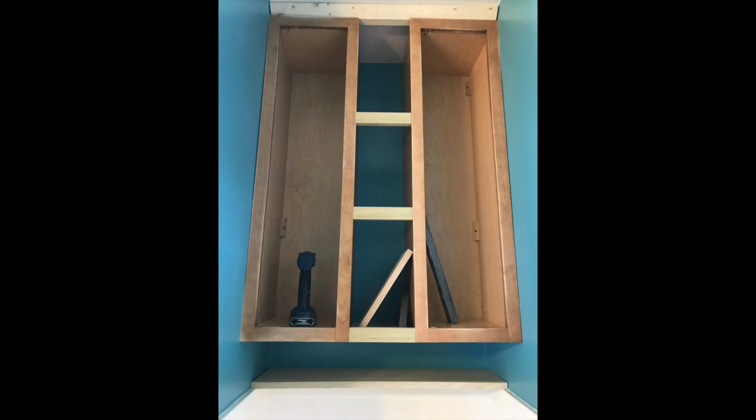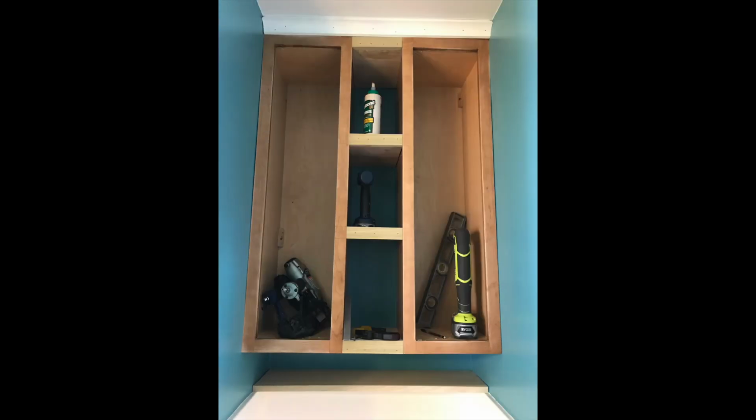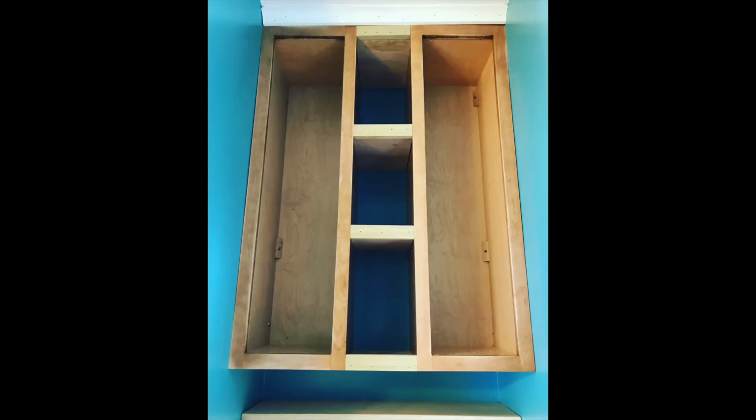All right, so one half of the cabinet is in. Here we go. Both of the two side cabinets are now in. With this cabinet reinstall, we had always planned to put a shelf there above the commode, but I had to scribe the wall because I swear there's not a square plumb wall in this whole house. The cabinet here is alder, and because it's going to be paint grade, I used poplar for the new face frame pieces.